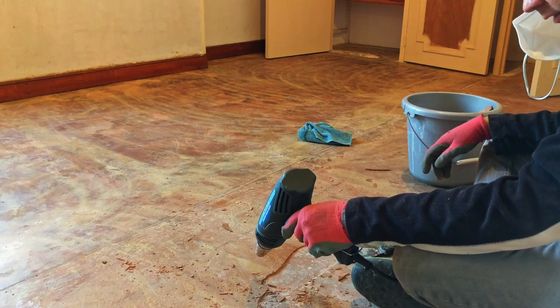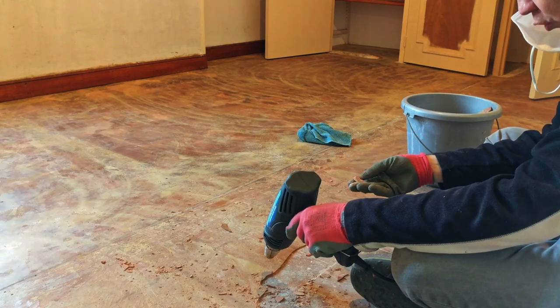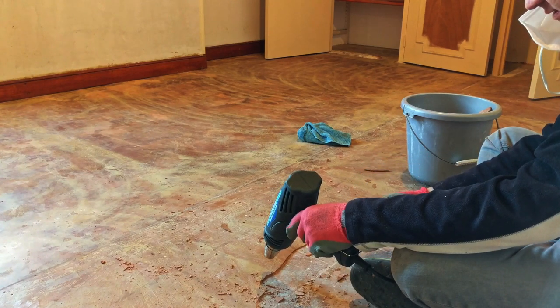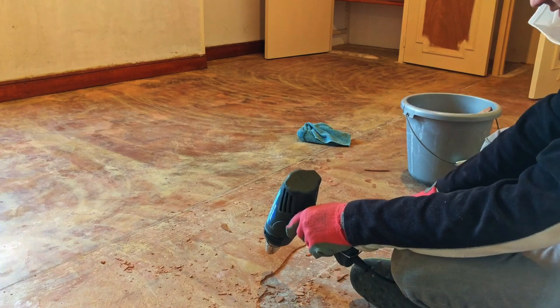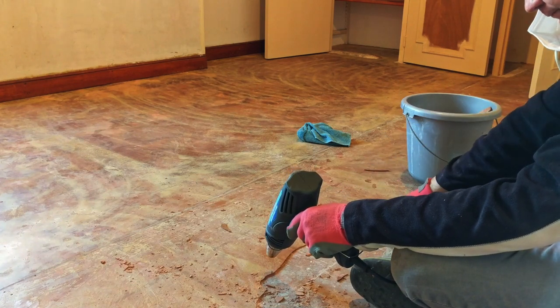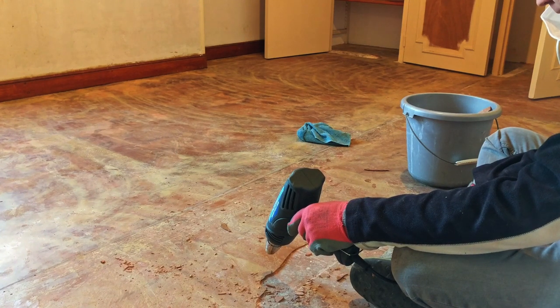It's interesting, right? You can hear this top left. So what I think it is is some sort of mortar, self-leveling compound mortar or something from probably the 60s. It's expanding, breaking its bond with the tiles, and every once in a while you can hear it go crack, and that's when it's easy for it to lift up. And then the gel stuff is actually on top. This is the glue for the vinyl floor or whatever it's called. But yeah, I'm quite amazed at how easy this is going. Obviously very slow, but I think we're going to be able to do this room.